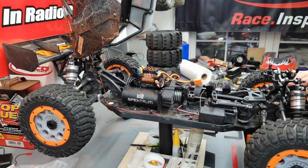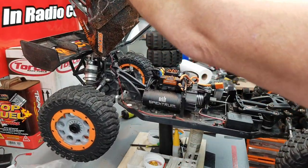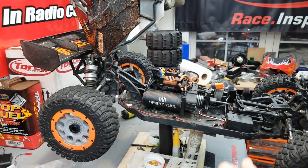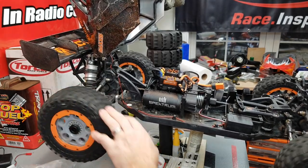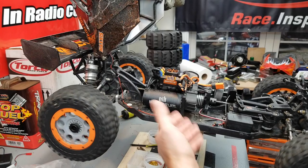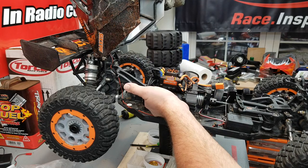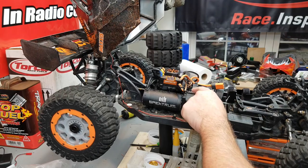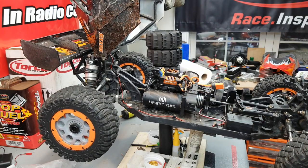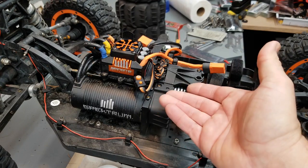So we'll just flip up the top here. Slide it forward a little bit so this top doesn't come crashing down. But you can see it's free spinning right now. And I just didn't realize it. I thought it was a dead battery, because we know once it gets to a dead battery, it still gives you steering but just doesn't operate the drive. So I just want to see what backed off on that pinion right there, whether we lost a set screw or what the heck happened. I have no idea. Maybe it heated up or something. I don't know.